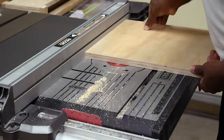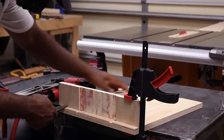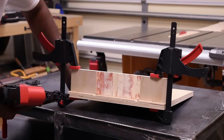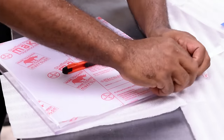The LEDs are top-mounted and recessing them will give a better appearance. Routing two tracks will make the strips flush to the surface. While I was at it I cut a short piece of wood and routed out the middle section — this is where I'm going to have the wire splice. This piece is nailed to the rear portion of the top. Prior to installing the glass in the trim I removed about a half inch of the protective paper.